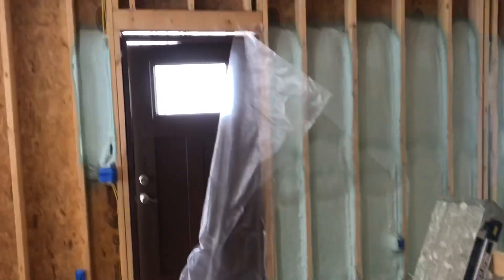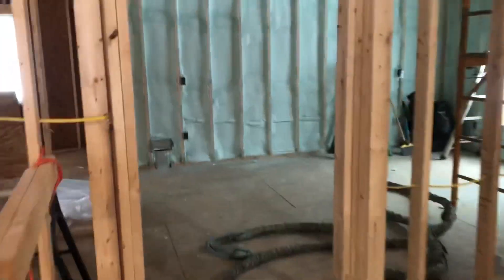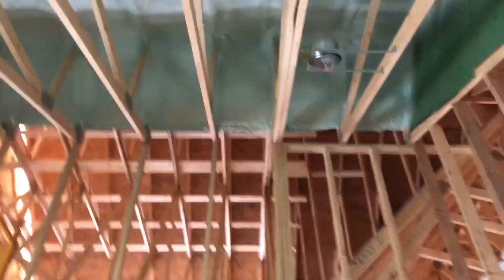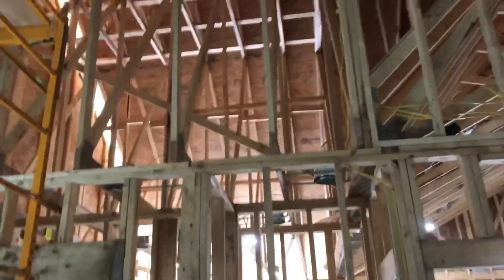Right here is just a spot I started to spray when we were running out of a set of drums. Zach was out getting those prepped and swapped over, so I just went there to get it emptied out. Then came up here, went up into this room — this is the time lapse videos you saw — got those walls sprayed. I sprayed all of that roof slope up there: six and a half inches of closed cell on that roof slope. And then that gable I was talking about — I sprayed that blocker. So now they can run sheetrock right up that vertical wall there to that corner, and from the backside, when I'm up spraying the attic floor, I'll be able to turn around and hit all of this all the way up and wrap up to my foam there, so that'll keep the thermal envelope intact.